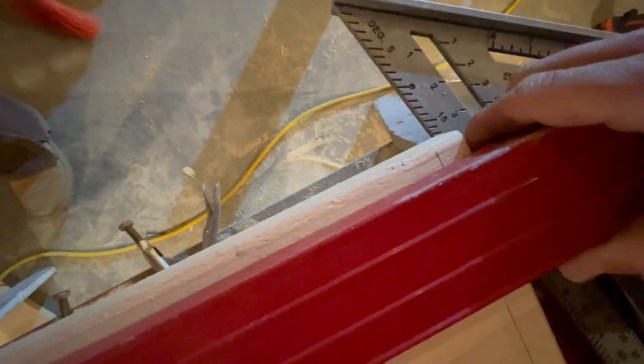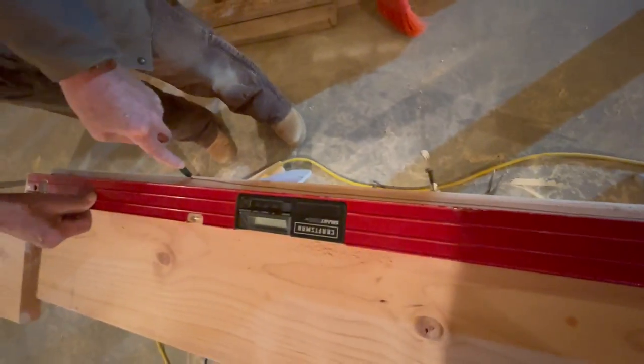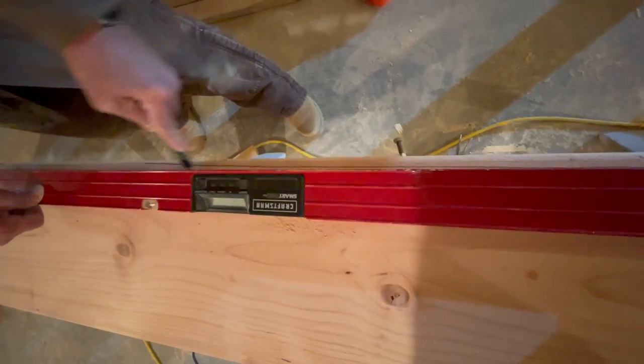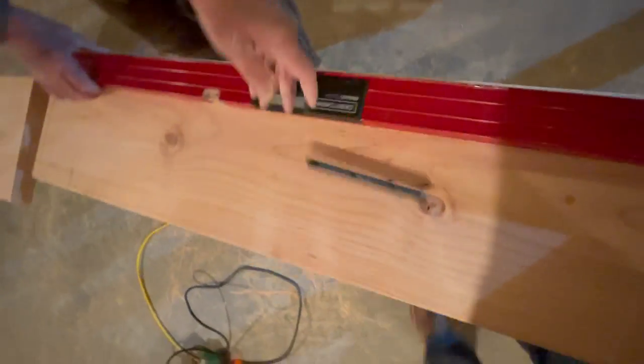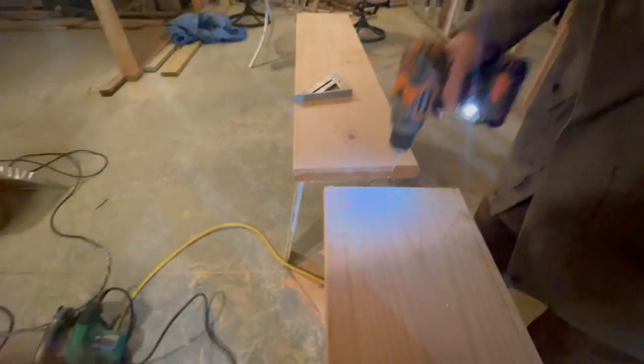Plus with the glue, he's throwing a screw in too. We're doing one screw on each side - we don't want squeaky steps. We're just going to trace a line here real quick, lining that up. Whoa, that took off at an angle - it caught a grain. Just remember when you're nailing, use that one. We're going to pre-drill those and get 16s in. That big three-inch screw - he's doing a little angle to help drive it, angled back to get a little bite and drive it in, plus it gets into the good wood.